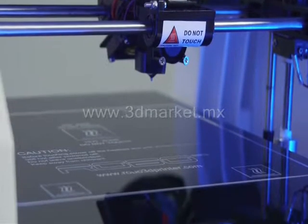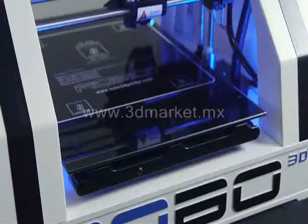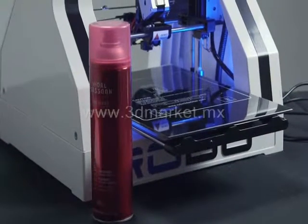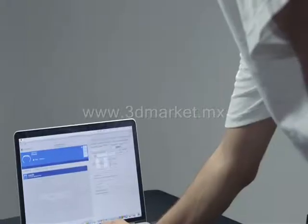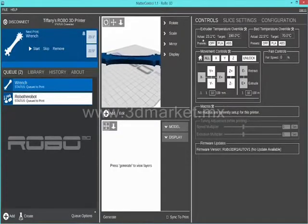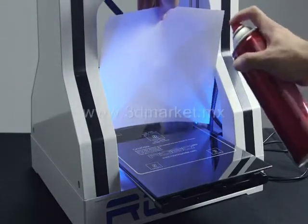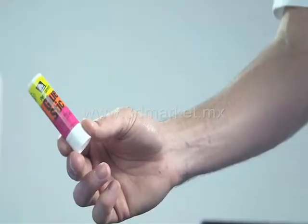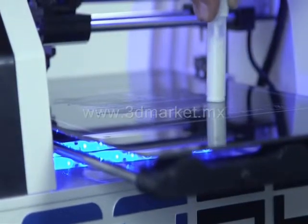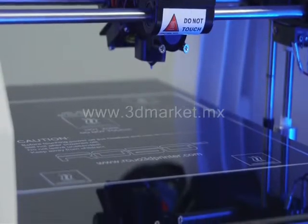We have come to know a few methods that will work well for helping the PLA and ABS to adhere to the print bed surface. Our favorite is to spray a thin coat of hair spray onto the surface of the bed while the print bed heat is maintained from 55 to 65 degrees Celsius. We recommend you shield the other parts of the printer from overspray with a piece of paper. It is also possible to use a glue stick — rub it on the surface of the print bed enough to cover the area you will be printing on.